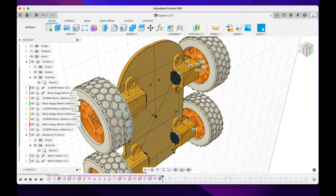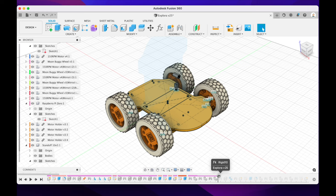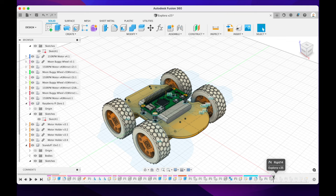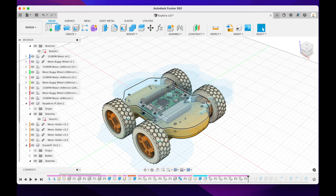Next, I mock up one of the standoffs — this is where we'll put the Raspberry Pi on top of the base plate with some space underneath, and that space is where I'm going to put the battery. The next couple of actions are basically replicating that standoff four times and joining them in place. I then bring in a model of the Raspberry Pi Zero and join it in place on top of the robot. Next, I quickly mock up a battery as a block — quite accurate to the size of my LiPo — and replicate those standoffs again so we've got four of them in place.